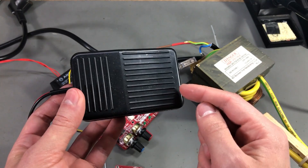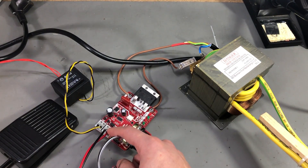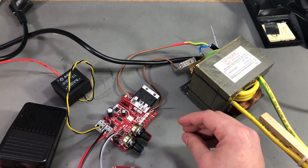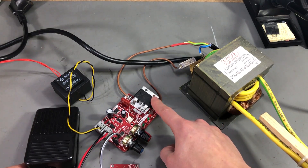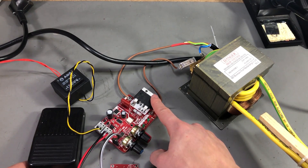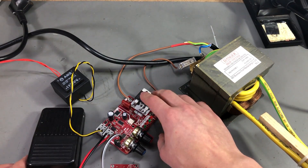You'll also need a simple pedal switch — I'll add a link in the description below, I got it from AliExpress. All you need to do is open it up, add a long wire, and connect it to the proper input on the board. The switch in this pedal is used to trigger the spot welder with your feet after you've correctly positioned the electrodes on the battery tabs. The controller board turns on or off the primary of the transformer using the onboard triac. The primary input has lower currents manageable with a triac of this size. It might also be a good idea to add a heatsink to the triac, but keep in mind the heatsink might become live and be connected to high voltages.